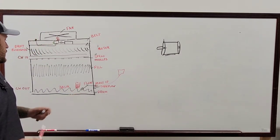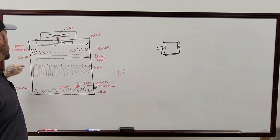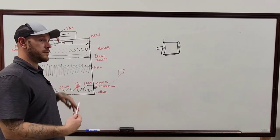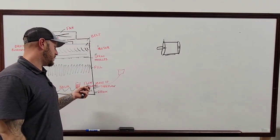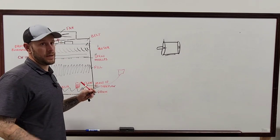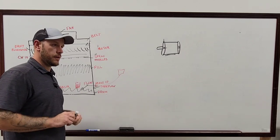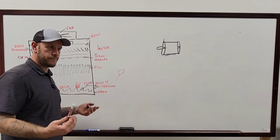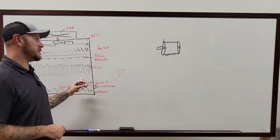What else? I mean, there's all kinds of stuff that can be on any of these lines before the tower, obviously. Obviously, you got isolation valves on all the lines going into the tower. If you don't, you want them. Most of the time on your makeup line, you definitely want to check the shutoff valve for your makeup water. If that doesn't shut off, obviously you're going to have a problem further down the road when you need to do any kind of maintenance to that tower. Even if you're going to shut it down at night, if that doesn't shut off, you're pretty much in trouble. It's a good idea to locate where all the shutoffs are on the tower that you're working on,